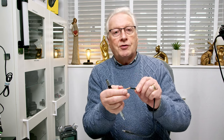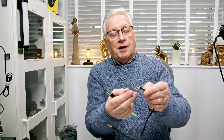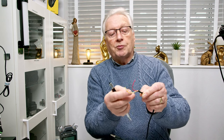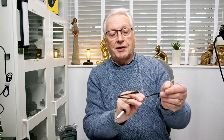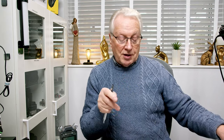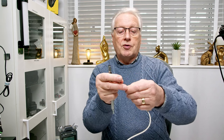The only thing you have to watch out for when building something like this for mic-level 5 millivolt inputs is not to use unscreened cables. This particular cable here — you can see we've got the red, white, and yellow conductors for the TRS tip, ring, and sleeve — it doesn't have a screen, so it could be susceptible to hum and electrical interference. It's best to use screened cable, and all the cables I've used on this device are screened.